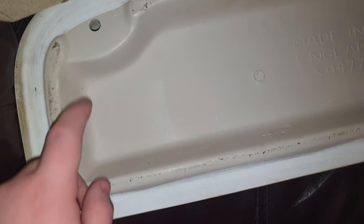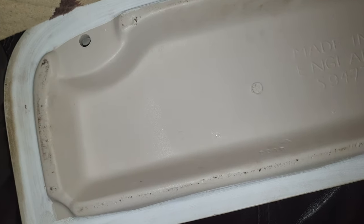The original Qualitas would have had a filling going around 'Bear' and would have had 'Qualitas England' underneath. The bumps in the tank - Ideal Standard made these with that so you could take an Ideal Standard close-coupling plate on the Qualitas version. You've got one 'Bear' mark and one down there too which you can't see because the siphon is in the way. By there - you can see a round mark - that's where the overflow hole used to be.